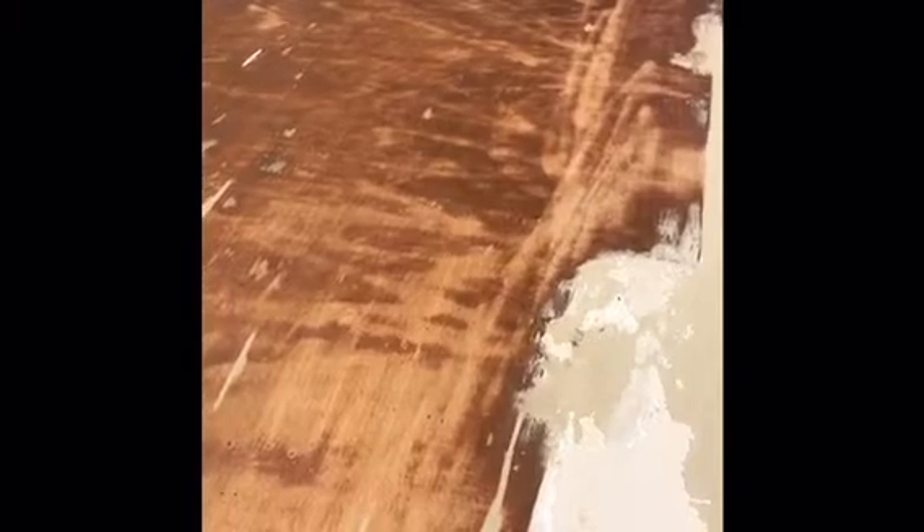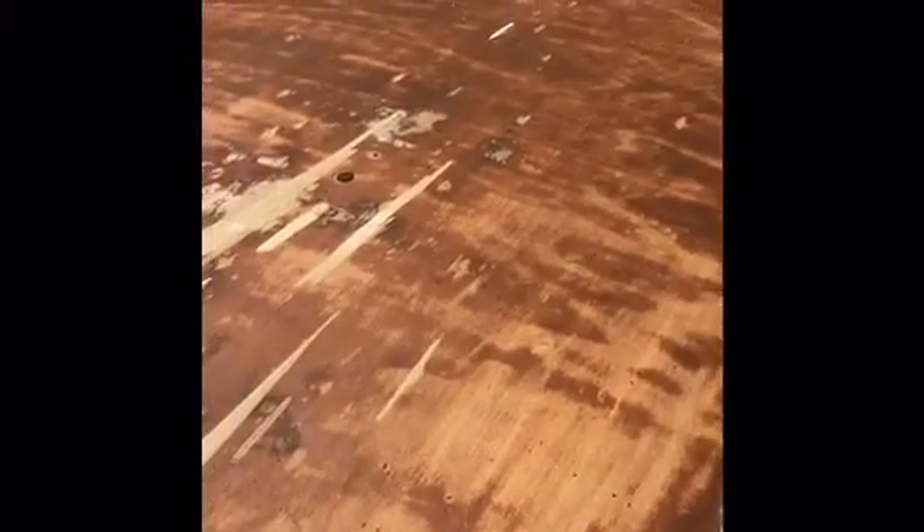You will need a lot of room to be able to spread out a full sheet without cracking or splitting it, and allow it to air dry. Remember, contact adhesive has to set for 15 to 20 minutes and air out before you can stick it together. Here is a sheet of laminate — bottom side up — and here's the front side, a nice brown copper color. Also make sure you run a white rag across it to ensure it is dust free and lint free, as any particles of dust will show through on the final product.